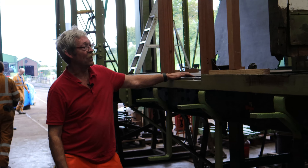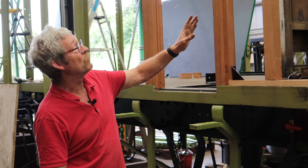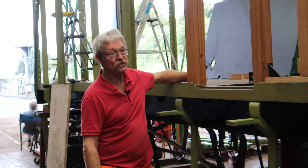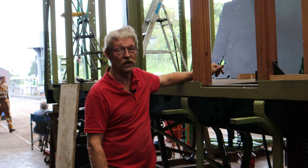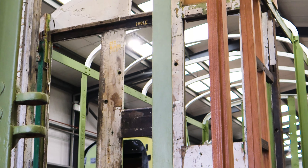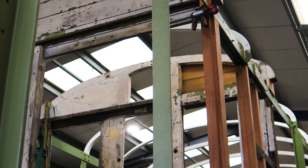As you can see at this stage, new door pillars have been made up to be put in with some of the original ones. Gordon has very cleverly managed to mortise and tenon it all back in, so we've got original bits and new bits all tied together with mortise and tenons. This wall over here you can see is already down and in complete with the original tenon into a new mortise.